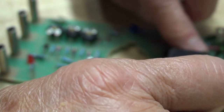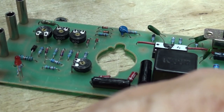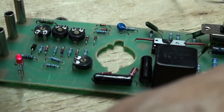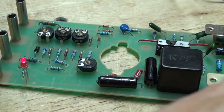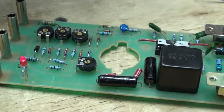The chip is cold because we know it's blown anyways. I'm moving the transistor. It didn't make it come on. Now, let me see. Not getting any voltage. Oh, the battery lead came off on the other end. Okay, I'm getting 9.2 volts. It's 6 AAs. All right, the battery lead was off on the other side over here.